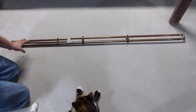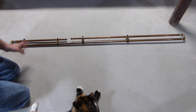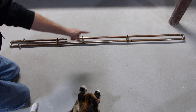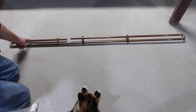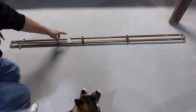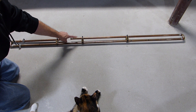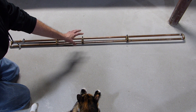This is a Slim Jim style antenna — I'll leave a link in the description to a few websites with more detail about its construction. On this side we have the radiating element, which is unbroken all the way up to the top. Over here on this side is the matching stub, just like on a J-Pole, and there is a gap between the matching stub and the part of the radiating element that's folded over and brought back down. This is all soldered together with standard plumbing solder.